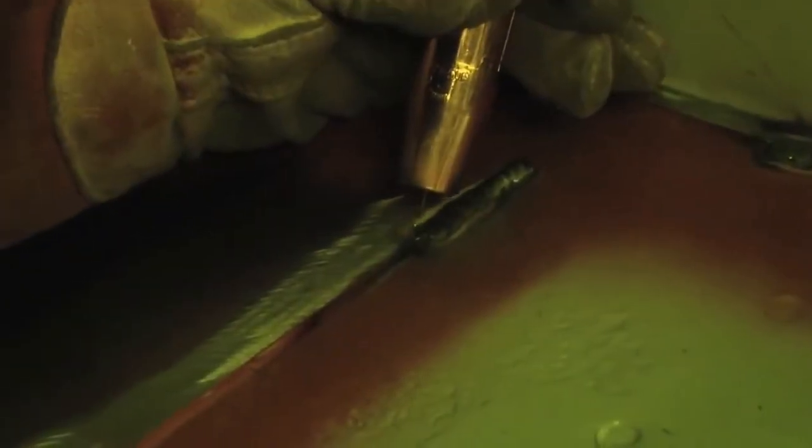What I've done is pulled both pans down for my butt weld. Now watch this butt weld, it's a little different. I'm on top of the cross member. If you watch the wire move in a little C action right there, and I'm able to close up that large gap right down onto the cross member. See the tip move just like that? Again, it's all technique. Don't forget to cool down. You'll be making beads exactly like this.